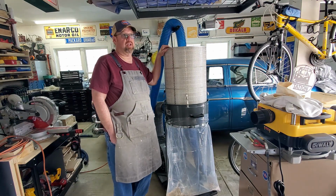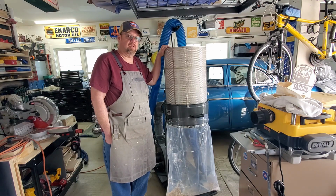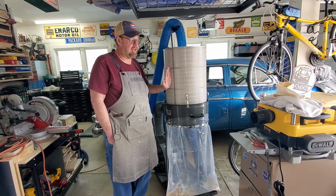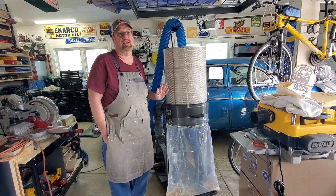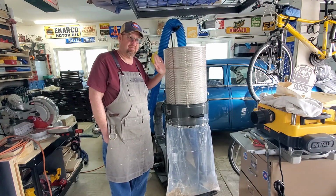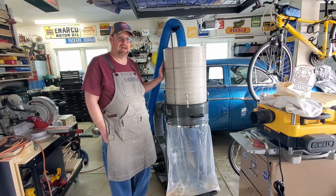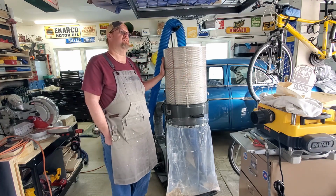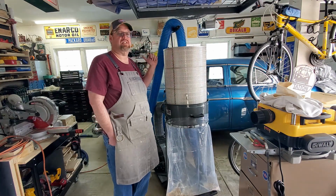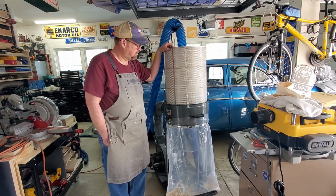So whether you put in a second stage on the front end, or whether you're using different kinds of piping, nothing matters unless it can exit the air that it's sucking in. If it can't exit, that air has to go somewhere. So you can have a bottleneck on the input side or a bottleneck on the output side, so to speak. This is basically solving any bottleneck on the output side, which should then increase the CFM on the input side because there's not that back pressure happening.